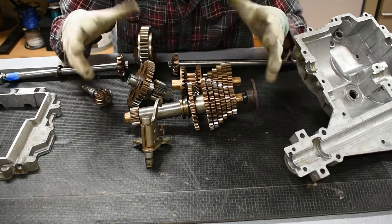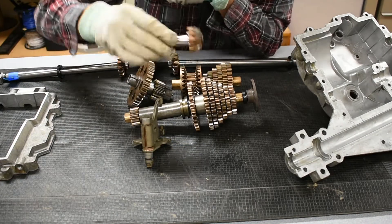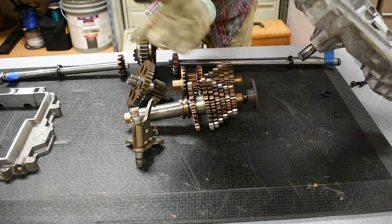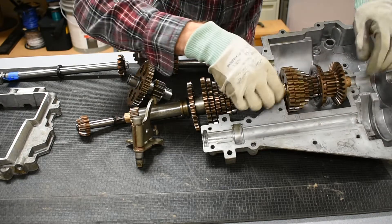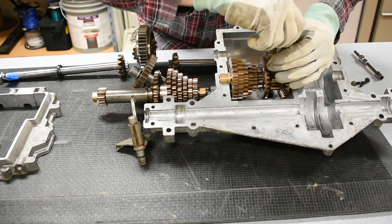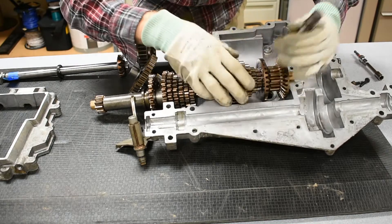Okay, so here's the whole disassembled part of this thing. We'll put the pieces back together one at a time and explain how it works and why it's constructed the way it is. Now we'll start with the power input. This piece is a bevel gear that attaches to the input axle. As I turn it, notice that all of the gears are turning. They are all linked to this axle and they all turn at the same time. There's no engaging or disengaging of whether the gears actually drive on the axle - every single one of them is attached, yet they are all separate.